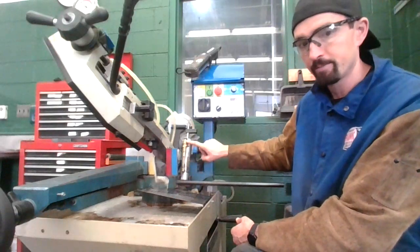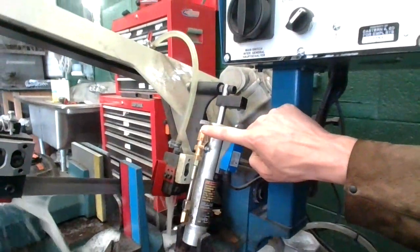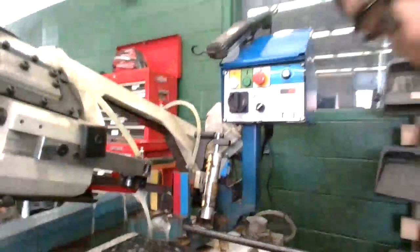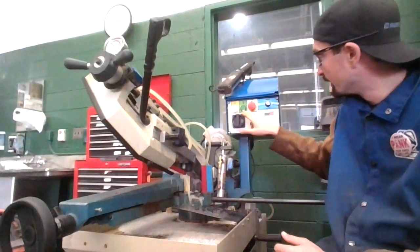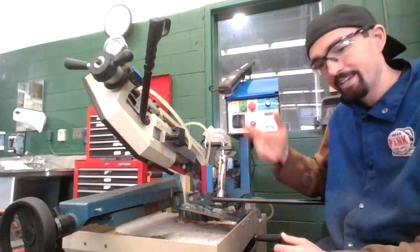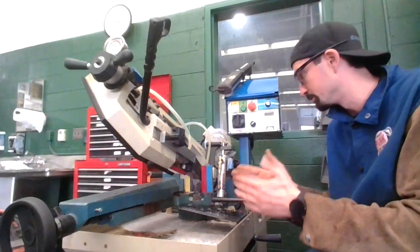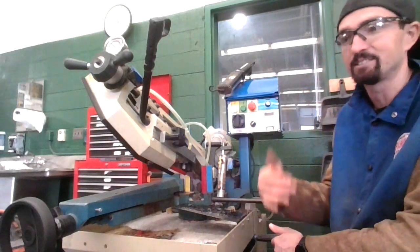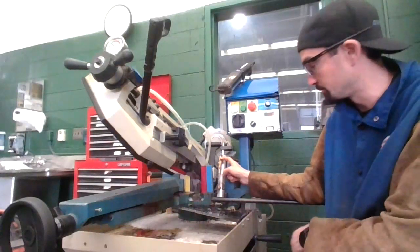So I'm going to use one finger. There's a little lever here. Let me zoom in on it. So this little lever, when I bring that up, and when I push it down, it allows it to descend. So you guys can hear where it's hitting, and then it makes a kerkunk noise. That's where it's hitting the dull spots where there's no teeth left. And then when it brings it back up, that's hitting teeth, and it's breaking off more teeth as it goes around.